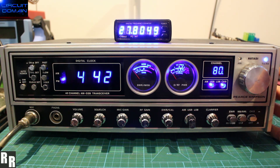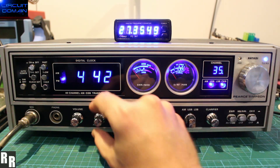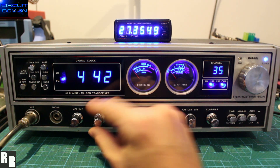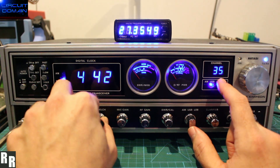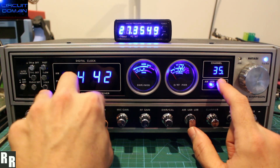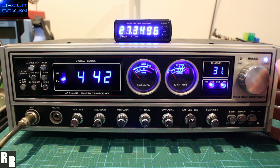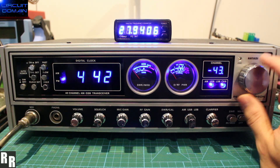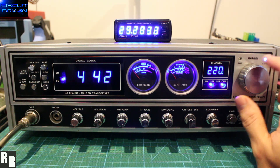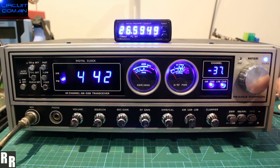One button press always takes you to home channel, currently set to 35. Two button press — as long as squelch is up high so you can see that little dot — off, on, off, on — when it is on, two button press will scan. Obviously that's just reflected on the counter. To scan the other way, you just turn clockwise, or anti-clockwise for down, clockwise for up. To stop: one button press, or open squelch. I'll take it back to 35 for now.